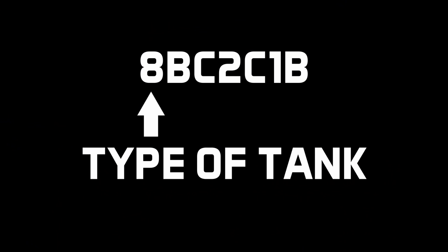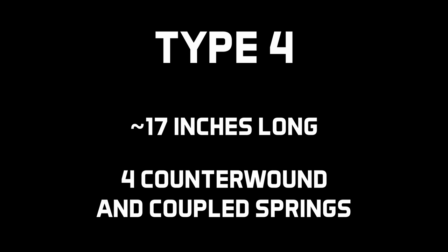So let's take a quick look at the most important of those, but there is a free PDF available on our website that breaks each digit down in detail, and the link is in the description. The first digit denotes the type of tank, and there are 3 common types: the type 4, which is the Hammond / Accutronics classic as we have here, and also found in the Fender Twin Reverb. That's just under 17 inches long and contains 4 counterwound and coupled springs. This is really the industry standard and will give you a great blend of lo-fi springiness and hi-fi reverbness.